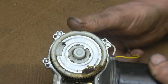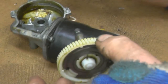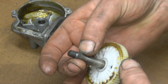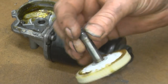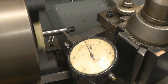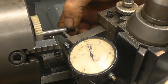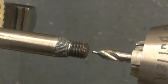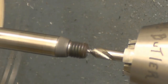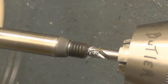Right, that's the plastic gear. And the metal part here is actually the metal wiper track for the intermittent wiper switch. So basically I'll need to carefully hold that in the four-jaw chuck, clock it in, centre drill it, and just machine that spline off there down to a nice square edge. I've managed to get the end to within a quarter of a thou — it looks like it's running nice and true. I haven't got a really tight hold on this so I'm going to gently countersink it, put a live centre in, and I just want to machine off that little taper there to leave a nice square shoulder. Really gently, because that centre drill has only one ambition in life and that's to snap off in the hole.